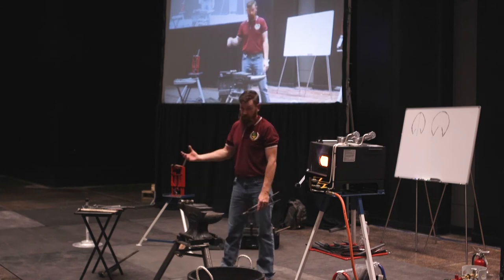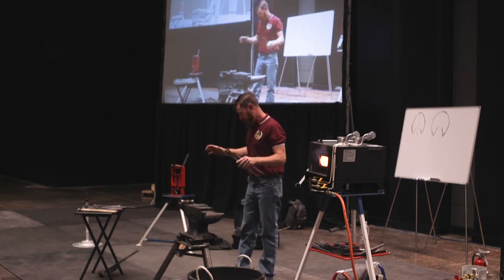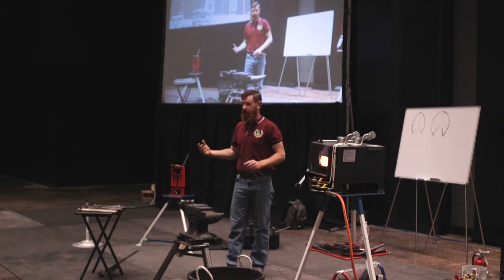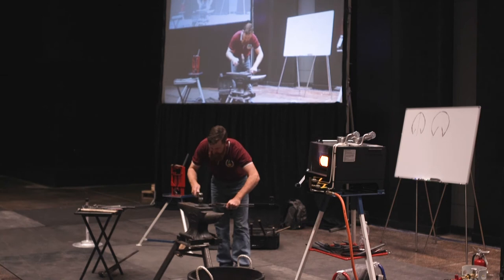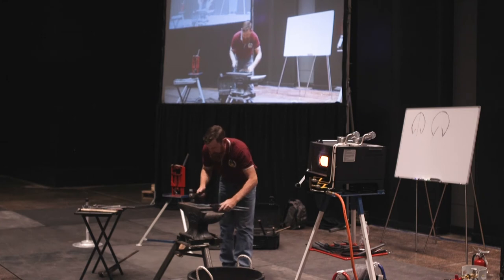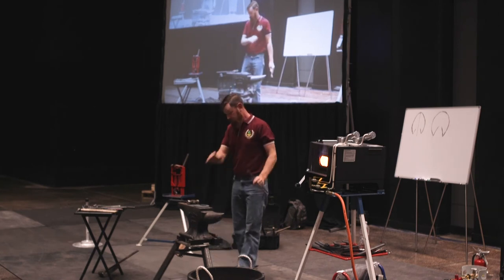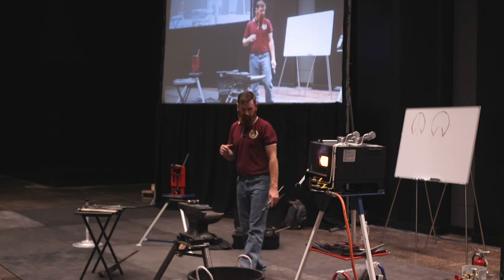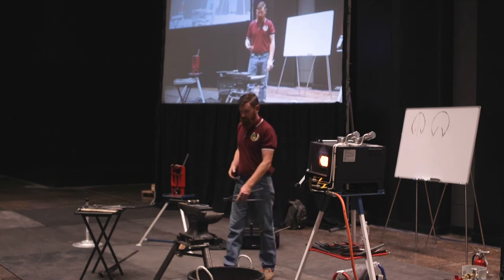Like I was showing before, going and putting that roll toe in, closing my shoe, sole pressure seeing that out, it's going to open my shoe. Knowing how all that material moves is massive, because if you put the perfect toe in and then you roll the toe, now you messed your toe up, and vice versa for other aspects. So you always want to make sure that you're not doing things twice and that you're pretty much only doing it once. Okay, so you're just going through and doing that right ahead. Plenty of time to go check my fit, see where I'm at, come back. That's my goal, whether I'm flipping, whether I'm doing rocker toe, whether I'm doing salad bowling, whether I'm doing extended heels, so on and so forth.